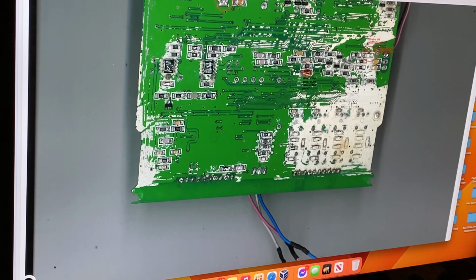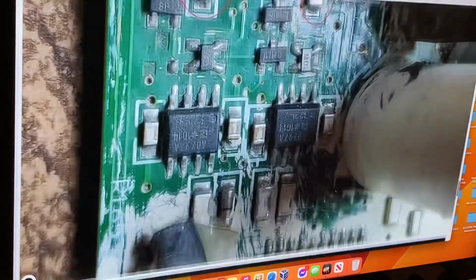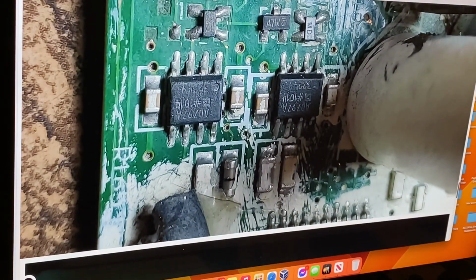So there's an N and a P channel there, and all you got to do is look at the supply rails on the other side of the board. If you actually measure the capacitors here, these are the filter capacitors for the rails on the op amps. You get for memory +5 here, -5 here, and +5 here, ground, ground, right? And this one here, one side is -5 volts, the other side is ground. So I know that's positive, and that's ground. If you measure there with the multimeter on continuity, whichever one beeps, more than likely is your other ground.